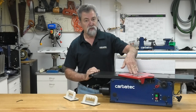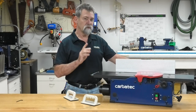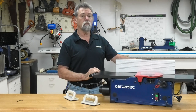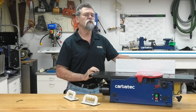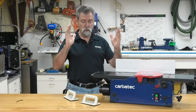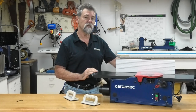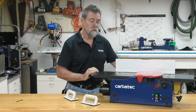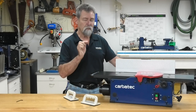Be sure that the blade guard is fitted and working correctly. In general, do not plane a workpiece thinner than 12mm, less than 19mm wide, or shorter than 300mm long. Do not exceed a maximum of 3mm depth of cut on narrow boards and 0.5mm on wider boards. Never plane a workpiece with loose knots or foreign objects embedded in it.